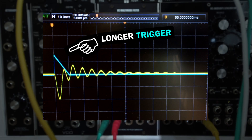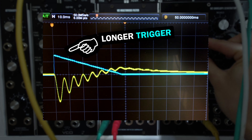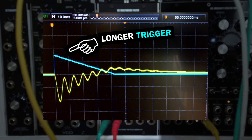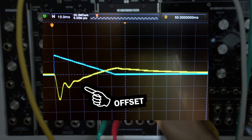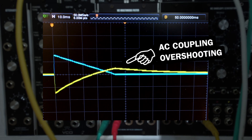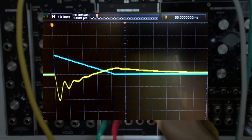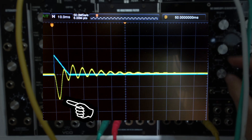Now let's use a longer trigger, which is more in line with what other analog synthesizers are capable of. As you can see, the filter ping waveform is being offset for the duration of the trigger, after which it will start oscillating around 0V again. This is also common analog filter behavior. There is also a little overshooting towards the end of the trigger, which is due to the AC coupling of the audio input. AC coupling removes undesired constant voltage offsets, which is important for audio processing. The more resonance we add, the higher the first impulse of the ping sound, which can be useful for emphasizing percussion sounds.